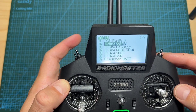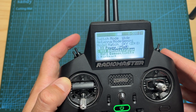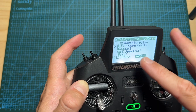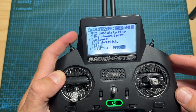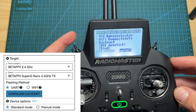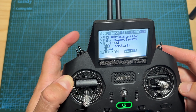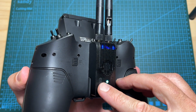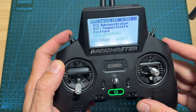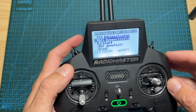Make sure that the baud rate is set to 921K. Setting up the radio module is done using the ExpressLRS Lua script. Out of the box the module comes pre-flashed with ExpressLRS 3.3.0, and currently at the moment of shooting this video the firmware is still not available in the ExpressLRS configurator tool, but I'm pretty sure that as soon as the module is released it's going to be available. In addition, you will be able to customize the two buttons using the web UI — you will need to enable Wi-Fi mode and then connect to the web interface of the radio module using your computer or mobile device.